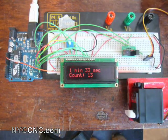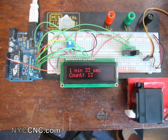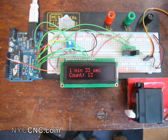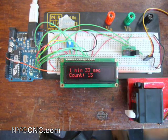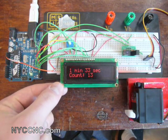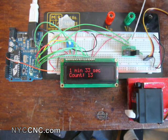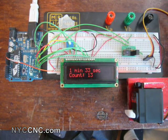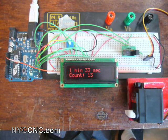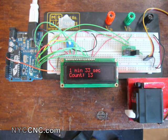I'm using the LCD from the Adafruit forums and website, which I'll link to on the blog. It's a great way to get into LCDs because it's really easy. You do use about six pins on the Arduino, but as you can see, I've got the LCD hooked up, one pin for the optical sensor, one pin for the servo, and still have a couple pins left.